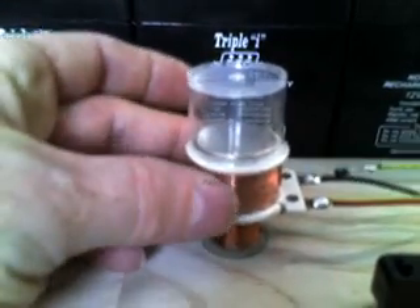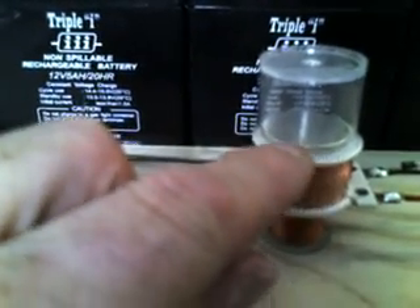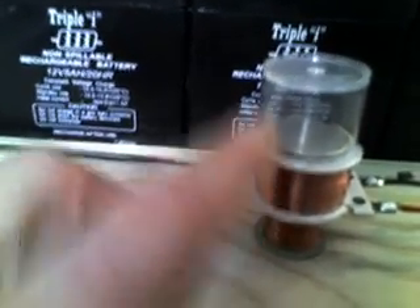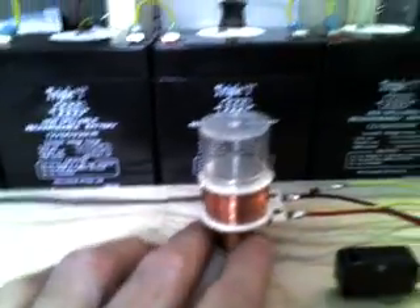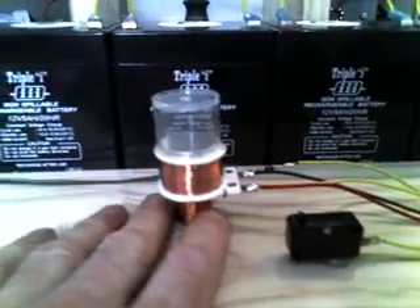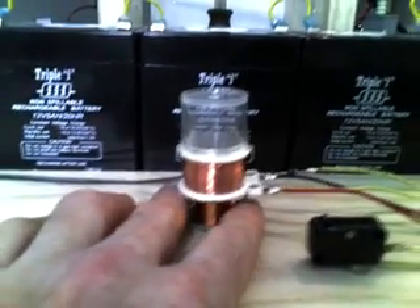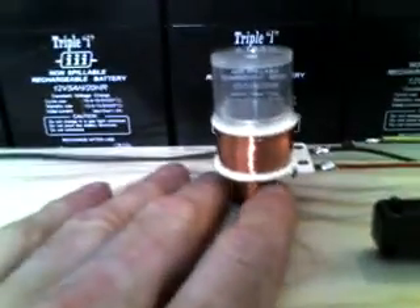This is the test coil here that I already had on the shelf. I have a one-inch neo magnet in there, about one-eighth of an inch thick. I've got it covered because the magnet vibrates a bit, and underneath I've got a small sense coil that goes to my probe for my scope, so I can look at the activity happening inside the coil. If I put my probes directly on the coil, the back collapsing fields are too powerful for the scope.